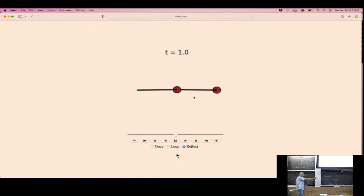That's the critical difference, it's really because these things line up. So think about the effect that moving this angle has on the end effector velocity, right? It moves in both X and Y here. But when I'm here, it only moves in Y, if I had a multi-jointed elbow, yeah? So the ability to command an X with respect to this is gone. And similarly, the ability to command in X, that direction, in this joint angle is gone. And the rank of that matrix is what tells you that's true. It's really just the trigonometry of what a small delta in that angle is going to produce at the end effector. So, yeah, sure.